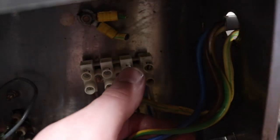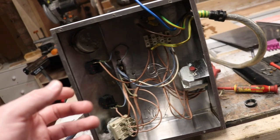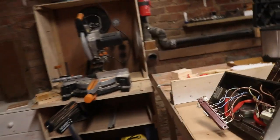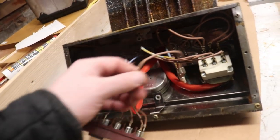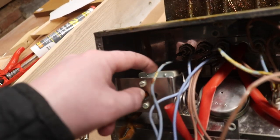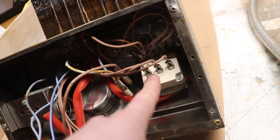The markings on these — L1, L2, L3 — gave me the idea that it was compatible, but I wasn't exactly sure how to wire it up, whether it would be a delta or star configuration. It looks like it's a star configuration — all the neutrals are coupled together in the center — and looking at this one we've got three lines in, with one of those lines tapped off for the indicator light.